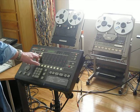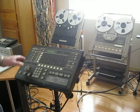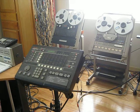I can also program in an offset, and the offset can be either positive or negative. So the slave drive can be so many frames, so many seconds, ahead or behind the master drive, if I so desire. So there's a lot of capability here in terms of being able to use both MIDI and analog recording techniques with the two drives.